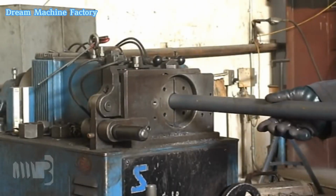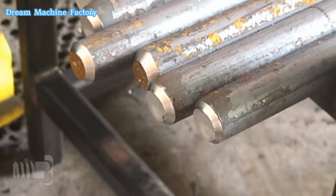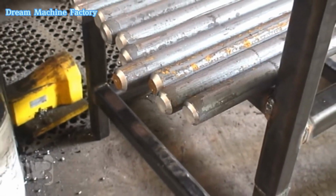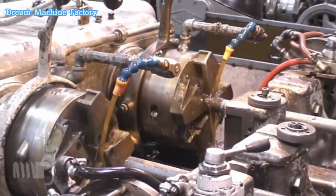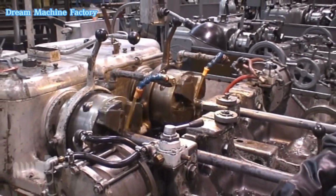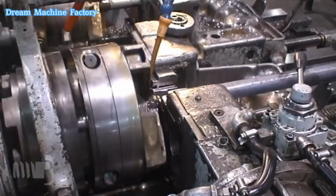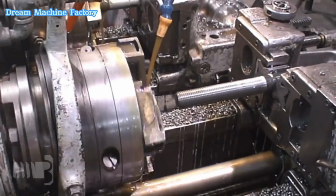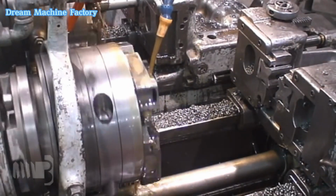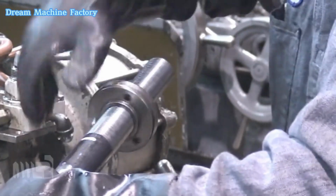Step 3. Chamfering. Before threading, a chamfer or bevel is added to the end of the bolt using high-speed cutting blades. Step 4. Threading. The threading process involves cutting threads onto the bolt using Landis threaders. These machines use rotating heads with cutting tools called chasers to remove steel and form precise threads. A continuous stream of cutting oil lubricates the process to prevent overheating and maintain sharp cuts.